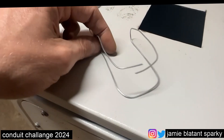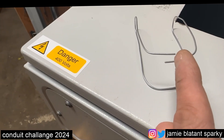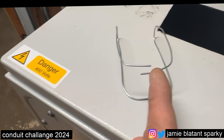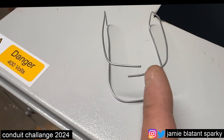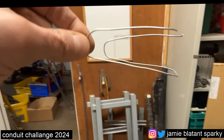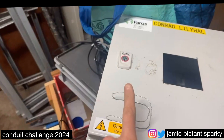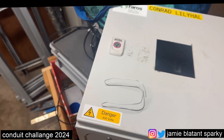I'll show you what you have to produce. This, you crazy kids, is a sledge. You can see how it's formed — it's got two 90s here, then two 180s, then two 90s. That's what you've got to produce. Now it doesn't sound that hard, but the ends of the conduit must meet — the ends as supplied — they just come together and get threaded on a runner, and you end up with that, which is called a sledge because it looks like a sledge.